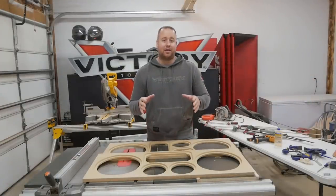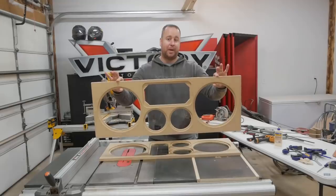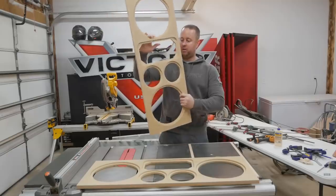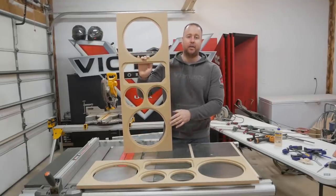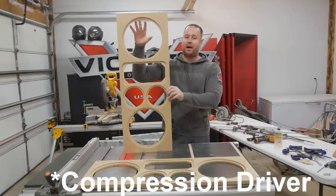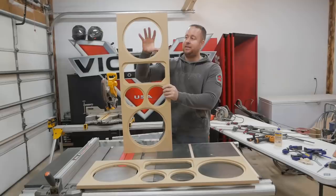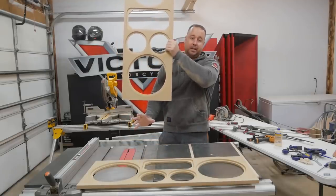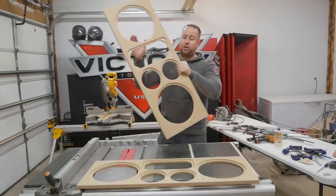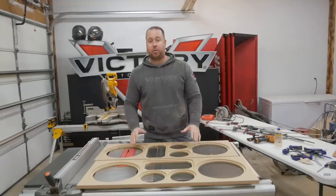With the surrounds out of the way it's time to move on to the front stage. This is the horizontal center baffle that will be staying the same, and the left and right speakers will be standing upright. Now this is where the tweeter's going to be going. I'd like it to be higher to be more ear level for my seats, so I'm going to be taking this top 12 inch woofer, relocating it down to the bottom, and that way it'll raise that tweeter up quite a bit. I'm also going to be making it ported as well while I redo that.